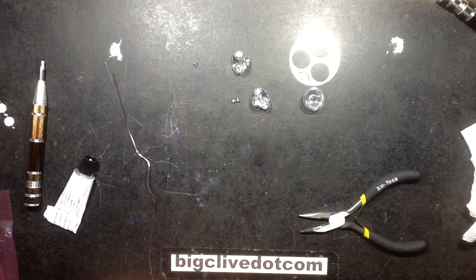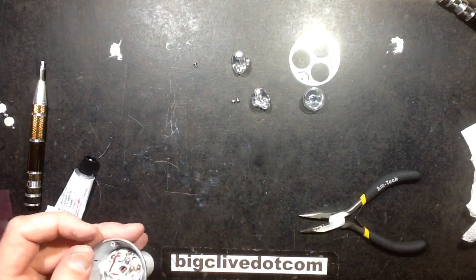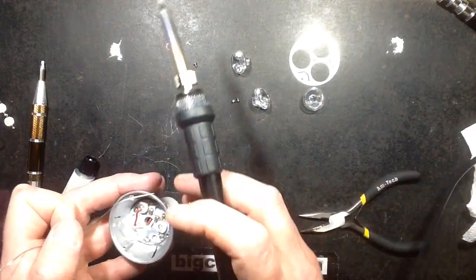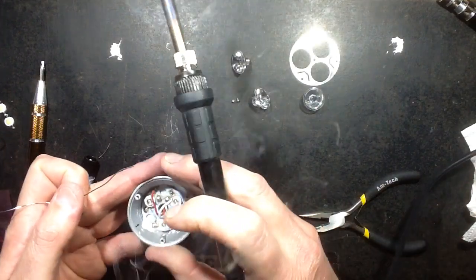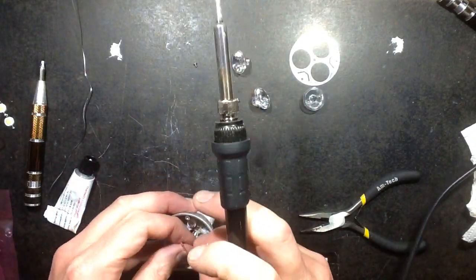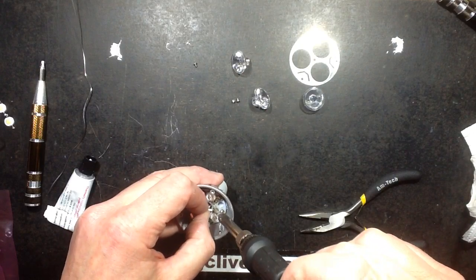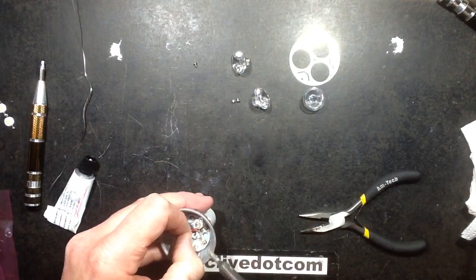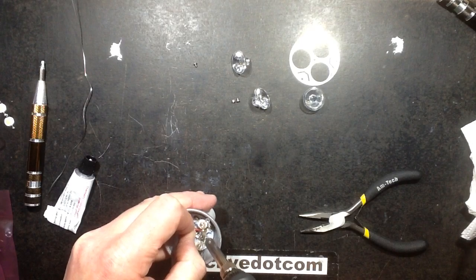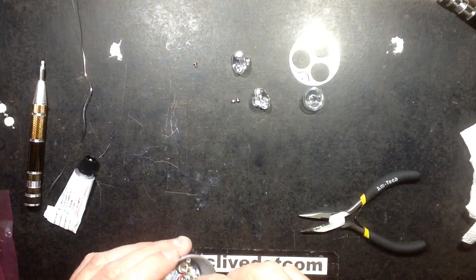So I'm not sure I'm going to shove those wires down. I can pull them up now. But let's solder this down. I'll re-tin these leads, since I've already tinned the pads, with some nice fresh lead. So that one's the negative terminal. And that went on a lot easier than it came off. Here's the positive terminal. And now I'm going to lift this circuit board out and put some heat sink compound in the back of it, and then reassemble it.